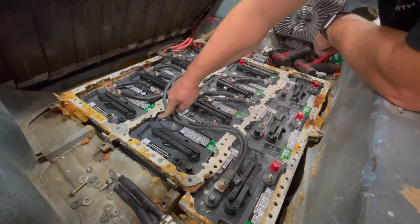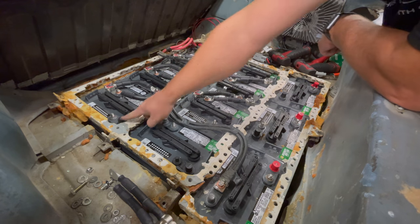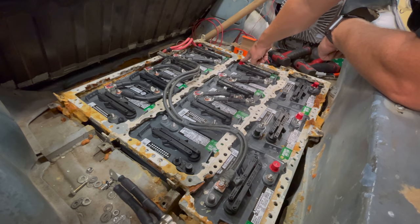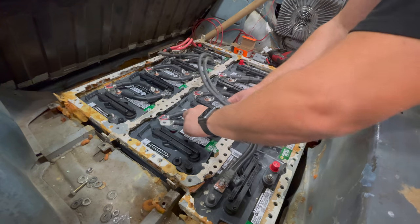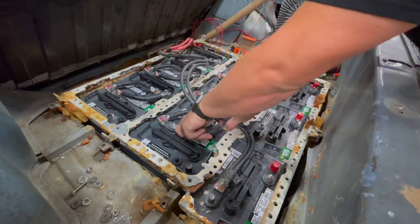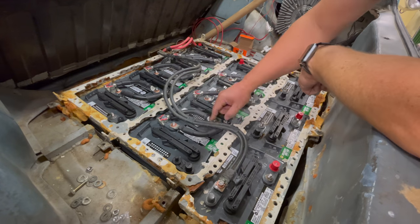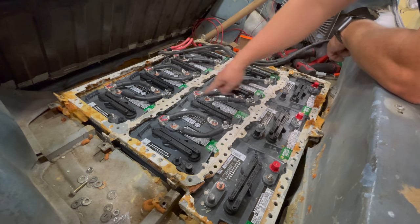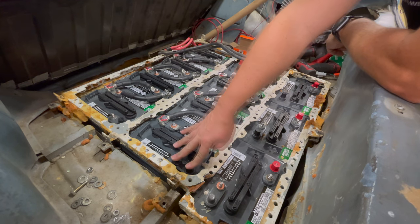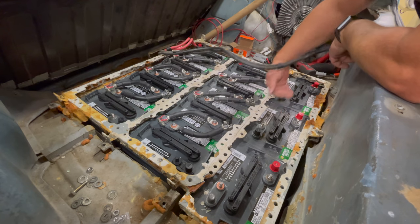If I jump from this negative to this positive, then this negative will have to come all the way up here. I think I'm better off just taking this negative over to this positive instead, so I can put these back the way they were. This means I'm going to have to make a few cables I didn't expect. If I jump from this negative over to this positive and run through the series, I've got a negative which needs to come down to this positive and run across that way.